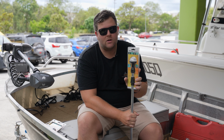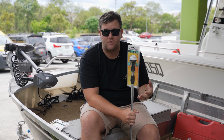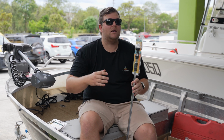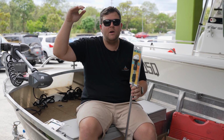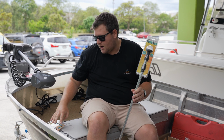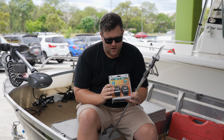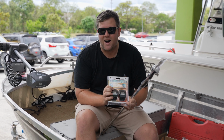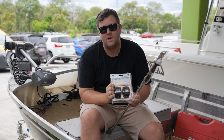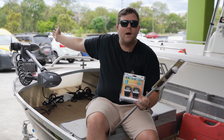Again, with our Queensland regulations, this particular light has to have an arc over a horizon of 360 degrees, meaning that regardless of the highest point of your boat, it must be visible 360 degrees. With our navigation lights, to comply with Queensland regulations, these have to have an arc of 112.5 degrees, meaning if it was shooting forward of the hull, it has to have that radius.